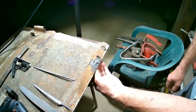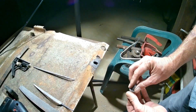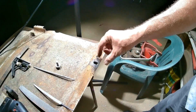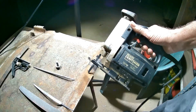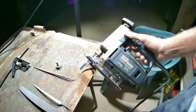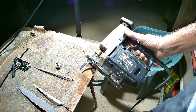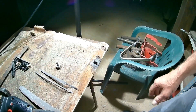There's a little bit of slop on the side like that in case I get off a little bit on the hole that I've got to put underneath the combine. Y'all saw me drilling on this — I got the two holes and they were off just a little bit. Then I took this antique — something that goes back to like the 1980s somewhere in there — but it's a good one called a jigsaw scroller saw. I put a metal cutting blade in it, cut out the two little pieces that were between the holes, and took some small files to clean it up a little bit. That finishes this piece.